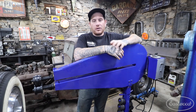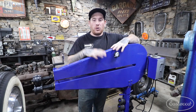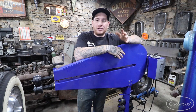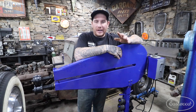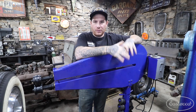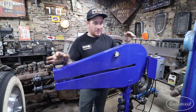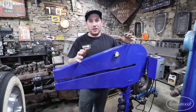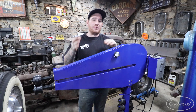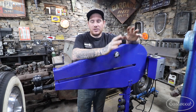That was a quick demo showing assembling my new 36-inch large motorized bead roller that I just put in my shop, and showing how I used it to create the strengthening beads in an inner door structure I'm building for my Model A Roadster. Now with my smaller 24-inch bead roller, even though I had the same dies, the same motor, and same function, it wouldn't have had the throat depth to make those corners to make that big square box design in the center that mimics the original.